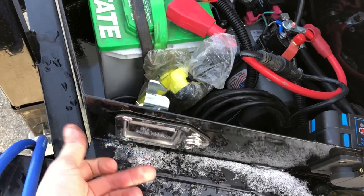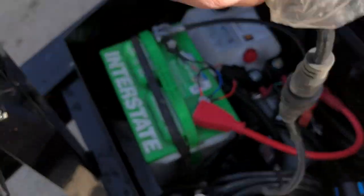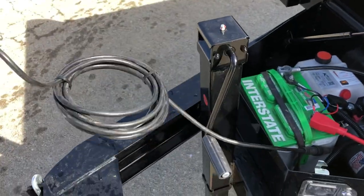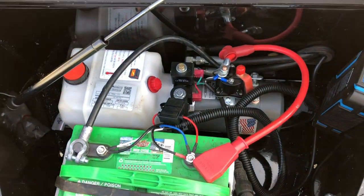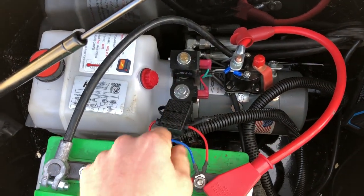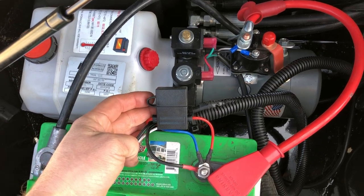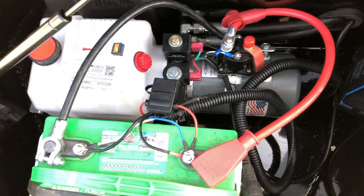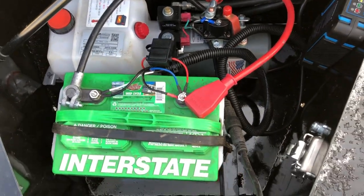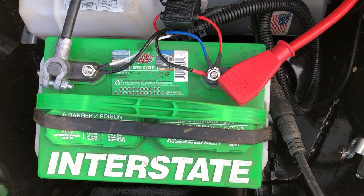It's got a paddle lock so you can lock your toolbox, with the keys in the back side. It's got a 20-foot all-weather remote cord so that you can take the fob all the way up to your vehicle. This is a power-up power-down hydraulic, as evidenced by the two coils on the solenoid, and then it's got an integrated circuit breaker for the power unit so there's no fuses to worry about. It's got an Interstate deep cycle marine battery — this is a high capacity group 24 battery.